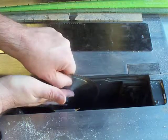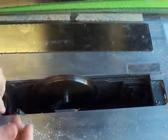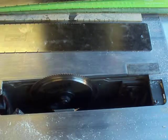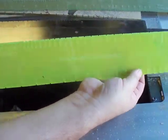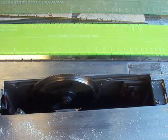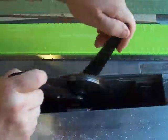I'm putting a table saw blade on here. If you ever buy a neck from us, you can know it's done precision ground — not only is it the right size blade, but we use a blade stabilizer so the blade's not in there wobbling. You know it's in there and it's done right. Once the blade's in, we've got these templates with all these different scales — different ukulele scales, different guitar scales that we use. You tape that to the back of your fingerboard blank, set up your blade height, run it through the saw, and go to town. Once I get the saw set up, I'll show you the sled we use to run it across there and show you a few passes so you get an idea of how the fret slots are cut.